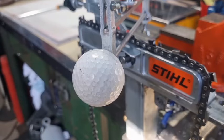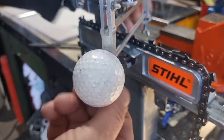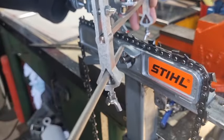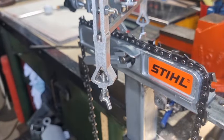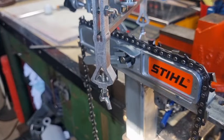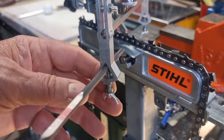We'll demonstrate how to set them up and use them. This is a 3/8 standard chain. Stihl recommends 5.2 millimeters, but I like to use a 5.5 millimeter file on my 3/8 chain when it's brand new, then I swap to a 5.2 millimeter file. A lot of manufacturers recommend a 5.5 millimeter file — that's 7/32.